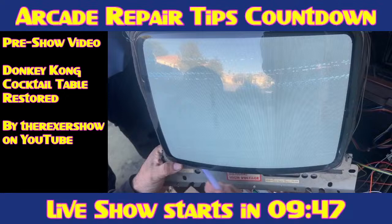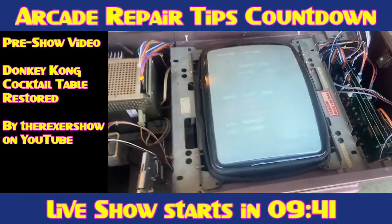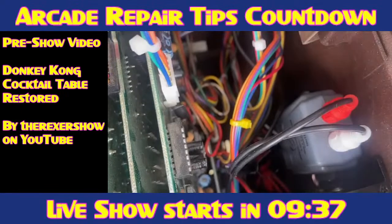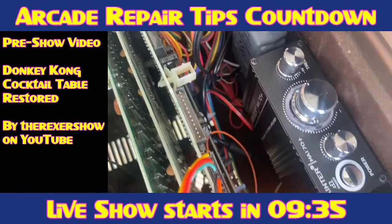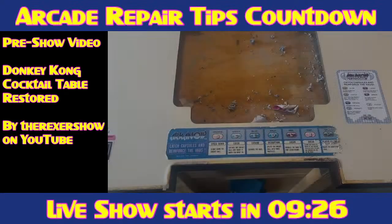The CRT was in good working condition except for a horizontal sync issue. I'd get it a cap kit and get that fixed from Sharp Image Repair, and then it would look wonderful. A little burn in, but that's okay. As for the audio, I used a line out converter with an amp instead of using the audio from the chassis. A little easier to control, as well a little bit more modernizing it.